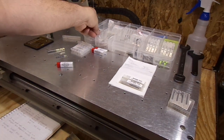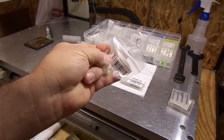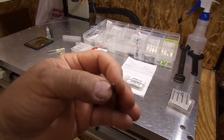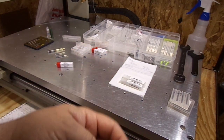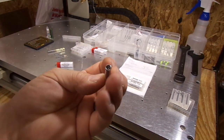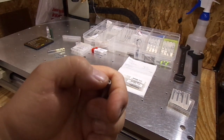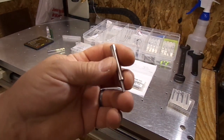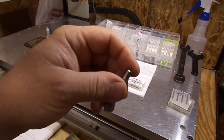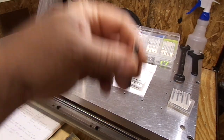You've seen in my past videos where I run the drag bit — this is a spring-loaded drag bit with a diamond tip. I've got several different angles; I think I have a 120-degree. I keep replacement tips because sometimes I break the tip off, and when you're doing two or three hundred dog tags you can't stop and wait a week for a new bit. I've got three or four of these — the whole tool is about 50 bucks, replacement tips are 25 bucks. I've buried the set screw to get as much spring tension as possible. I bury it about 80 to 100 thou — don't go too deep or you need to adjust your retract height in Fusion or you'll ruin your part.